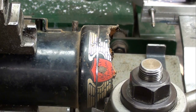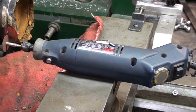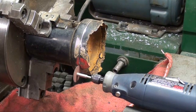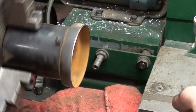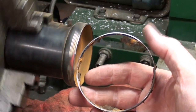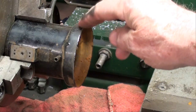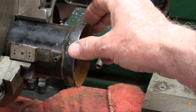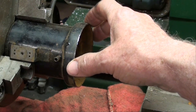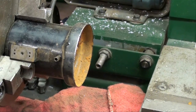Here's how I'm cutting the boiler off — using my Dremel tool, just laying on the compound and running the lathe ever so slowly in reverse, grinding it off with a cutoff wheel. That worked far better than I expected: it cut off cleanly and squarely, and I still have good sound metal at that point. Now I'll proceed to grind and clean this off both inside and out so that if I go to silver solder it, it's down to base metal and incredibly clean. That was a good idea if I dare say so myself.